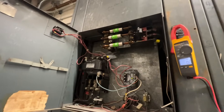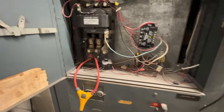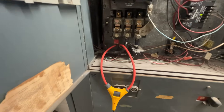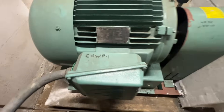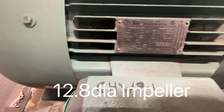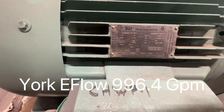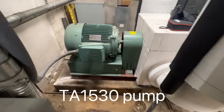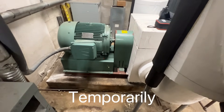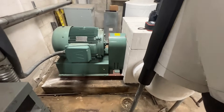We've hooked up the I-Flex so we can check the current draw safely. Here we are at 79 on the load side, number 1. Our amp rating for 460 volt is 71.2. If we throw the service factor in there, we've got a 1.25. So according to my calculations, with that service factor at 1.25, we could go to 89 amps - but I don't want to go to 89 amps. I'd like to see this thing closer to rated amps. So we may have to do some throttling here on this pump.